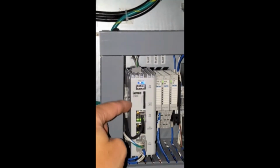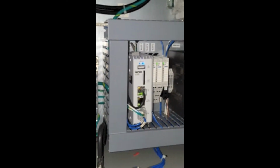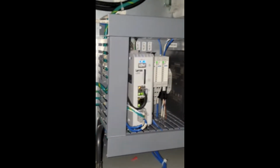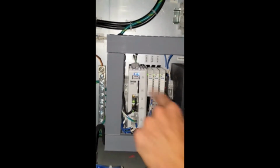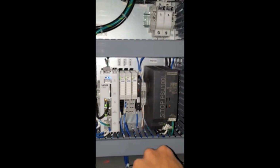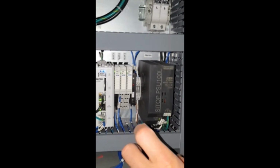Additionally, you should have these two little lights on your X3 connector illuminated, and the one lower light on the X2 connector illuminated. That's your standby OK status for the C300. And then as we go to the right, your power I/O on the S701 module, your run light on the S202 module, and your run light on the S200 module let you know that those boards have power.